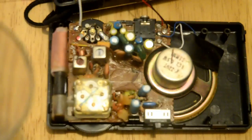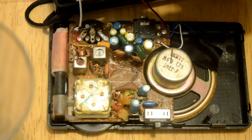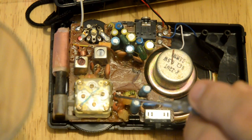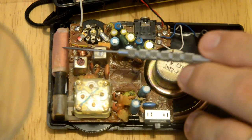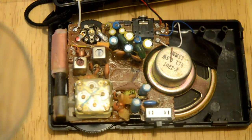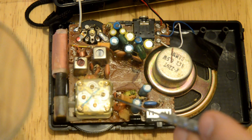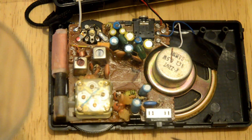What we're going to do is take some magnet wire — about six inches of 26-gauge — and connect it here, which I believe is the common ground, and connect it here as well, at the same points as the flesh-colored wire connects on the opposite side, right above the tuner. This is what tunes the radio. Then we're going to run another line outside the casing so we can connect a big antenna to it, and that will collect the shortwave radio waves.